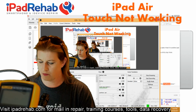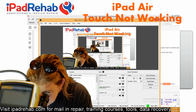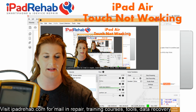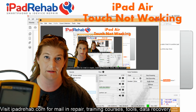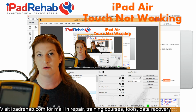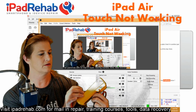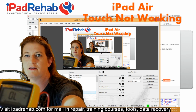Now, what we can do is, we never did ask the question of why is that enable signal not being generated? Maybe it is being generated, but it's short to ground or open line. So we didn't feel like taking the board out, but we can test to see whether or not that line is short to ground by comparing to a known good board. So let's do that first. If we have a simple short, then we don't really need to even go through all this trouble.